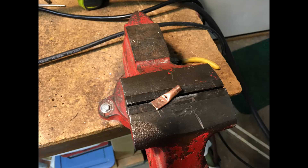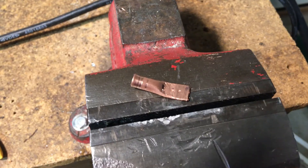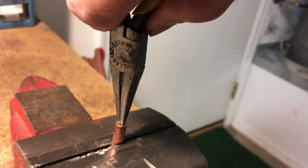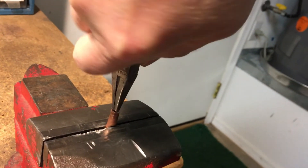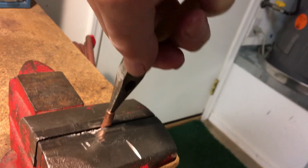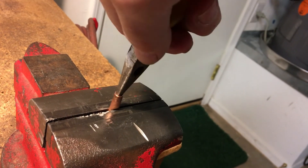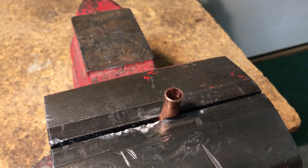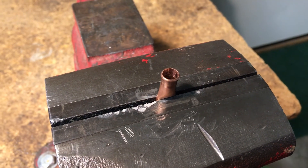To make the cable terminals, I used some old 1/4 inch copper tubing cut into pieces about 1 and 1/8 inches long. I flattened one end in a vise, then hammered the flat end out just a little flatter and a little wider. I drilled the appropriate sized hole in the flattened end. The 8-gauge jumper cable almost fits into the homemade terminals, but if you ream out and expand the open end of the tubing with some needle-nose pliers, the jumper cable slips in perfectly. I put some shrink tubing over the cable, then soldered the terminal using a propane torch and rosin core solder. I had some flux, so I used that too.